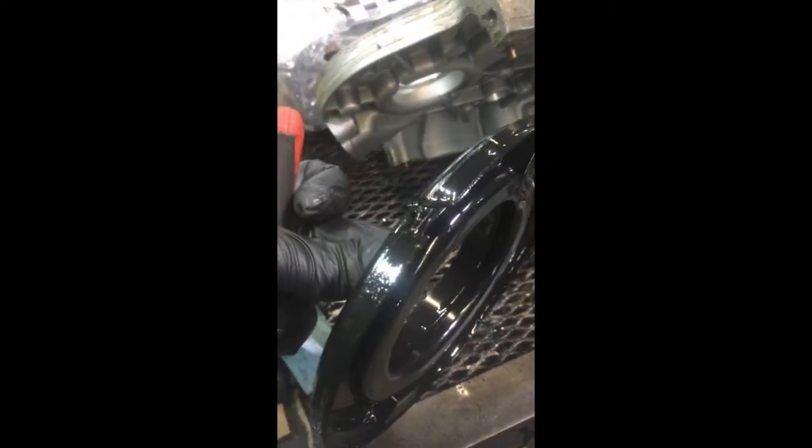Got the old piston out — there's that bad o-ring. Got the new piston sitting in here. Keep in mind — see how that flange is out, not in? Same way on the inside seal. Make sure you lubricate those seals real well before going together. Those flanges go out, so you have to keep them from cutting on the steel, both the inside and outside. I'm going to use this pick and go around the edge as I push down.